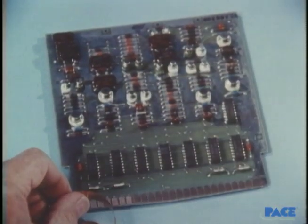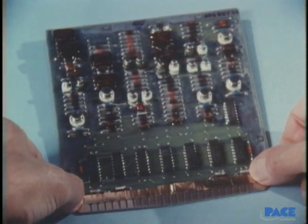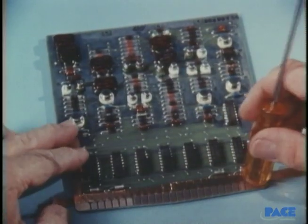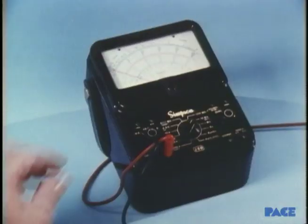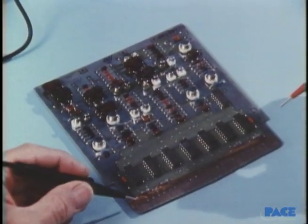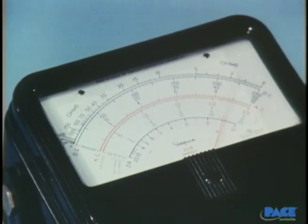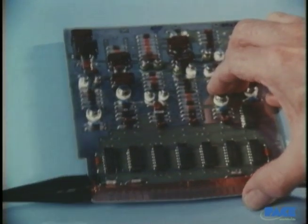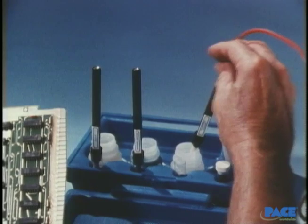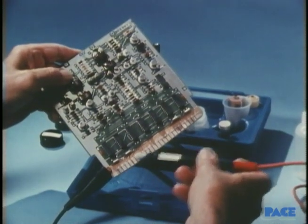The preparation of the board is simple. A piece of copper tape is used — it serves as a press-on electrode that straps across all of the contacts to be plated. Pressing it down well ensures a good connection. A good idea is to check the continuity between each lead and the tape using an ohmmeter or continuity tester. The contacts are then made electrically negative by clipping on the cathode lead from the power supply. The positive lead is then attached to the first swab anode, which has been dipped in the electrocleaning solution.